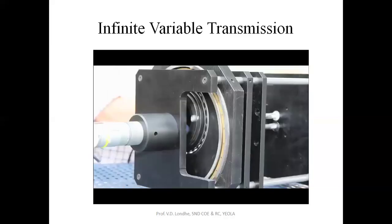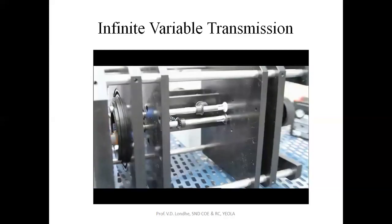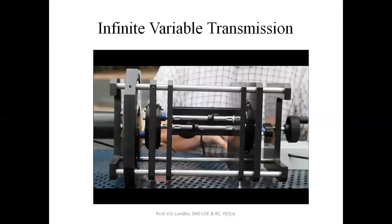So it's simple. The input shaft drives a ring gear that's eccentrically mounted in an orbital gear. The back of that ring gear drives the bottom shaft as well as sun gears on both the input and output sides. On the input side, there's a rigidly mounted planet gear driven by the first sun gear sitting inside a ring gear that's able to revolve.